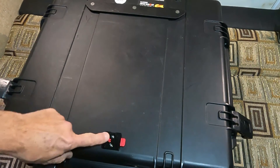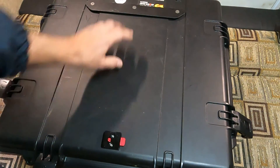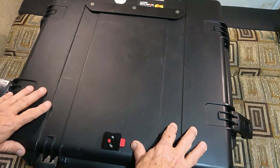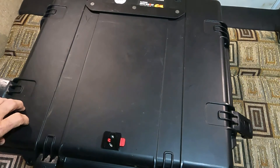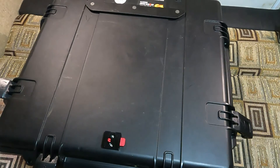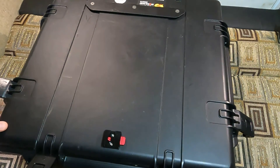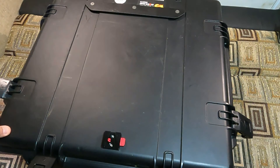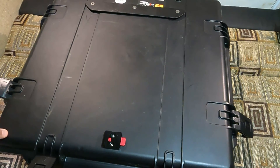The antenna will snap in on the top. It's got a special plate on the bottom that snaps into this. You can put this on the roof, provide it with 12 volts, strap it down to the roof rack and you're in service. At a higher speed in theory because the dish is bigger, and depending on your plan — if you put a commercial business plan on it with priority — you definitely get higher speed. They work very well; we've used it a few times over the past year.